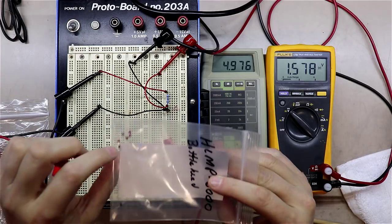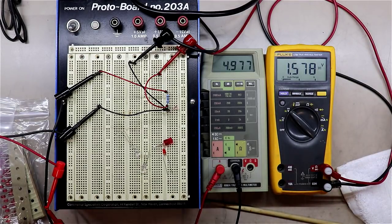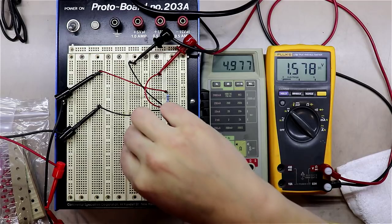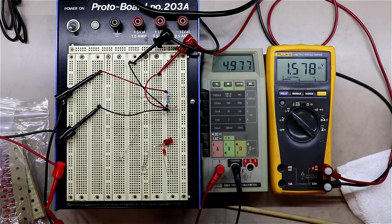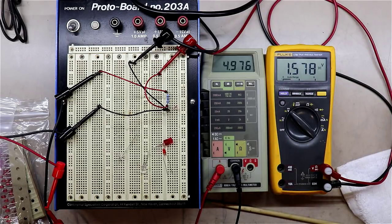By the way, I haven't sat here and gone through a whole bag of these to try to find one that might be a little lower and then find one that's going to match it. I won't show you that whole process, but you kind of get the gist of what I'm up to here. And look, this is a little bit more of an art than it is a science. If you dropped in one that was at 1.6 volts, you may or may not even notice the difference. So anything in this 1.5 volt range should get you pretty close. And like I say, you can always roll a little bit with the resistor to get it exactly at the current you want to bias the tube at. So, all right, now that we've done that, I'm going to pick out a couple of these, and then we're going to jump back over and finish wiring up this amp.